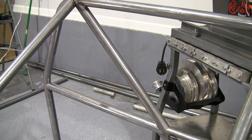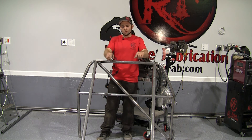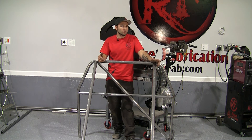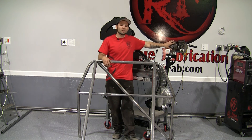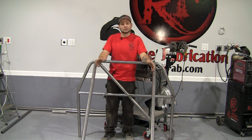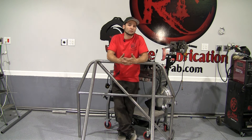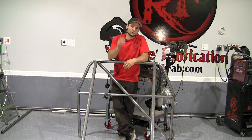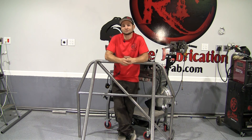Now that we've got this notch cleaned up for the diagonal bar, the gap is nice and tight and ready to be welded. The next steps for this project: we would put it back in the car, weld on the plates at the four points where it attaches to the vehicle, and then it would get welded or bolted to the car. We've now shown you how to do all the bending on a Rogue Fab Model 600 and all the notching on a Rogue Fab Versa Notcher. We hope you've learned something from this video — please leave us a comment below with your thoughts or ideas for future content. Don't forget to subscribe and check the box for notifications so you can be the first to see new content. Thank you very much for watching.